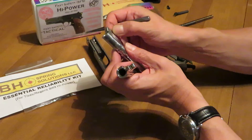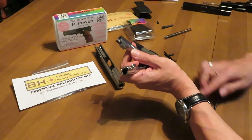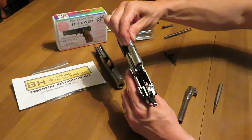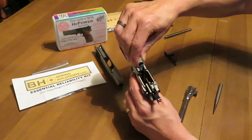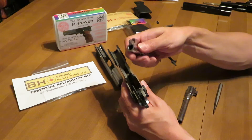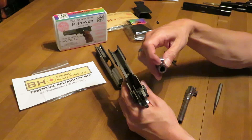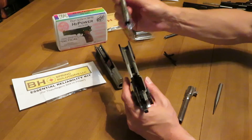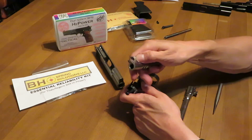The Tisas has 5,800 rounds, and it's already showing deformation at the edges. Can that really cause a big problem? Yes — I can feel it raised up on the corners. Eventually that can cause a problem because the fitment between the frame and that barrel lug cam has almost no lateral movement. Once you get enough deflection on these corners, you're widening the dimension of the barrel cam. There could be a malfunction caused by this deformation if it gets severe enough over time, and I don't think it's going to get any better.